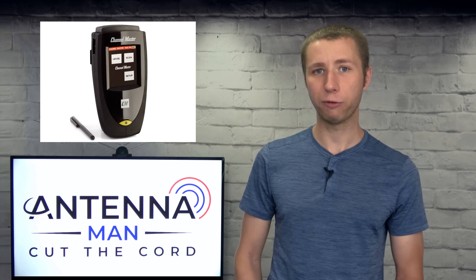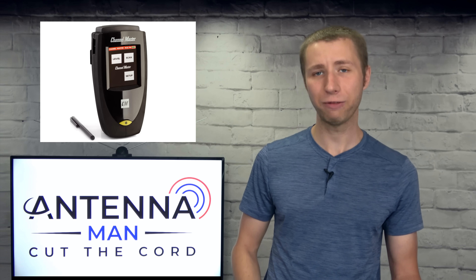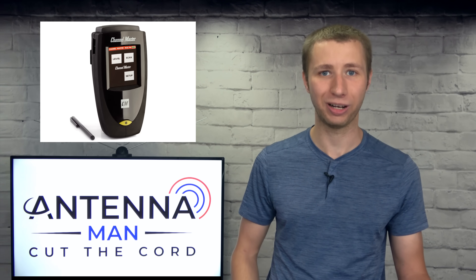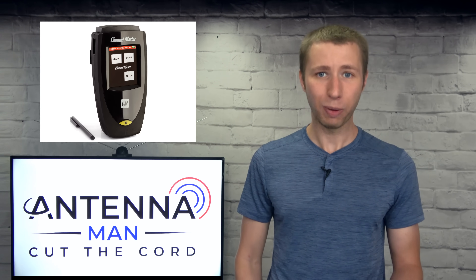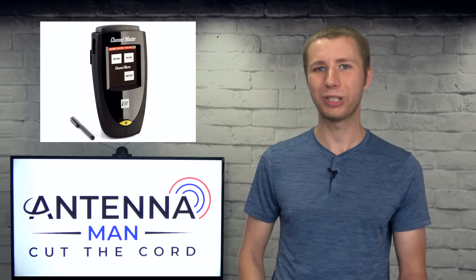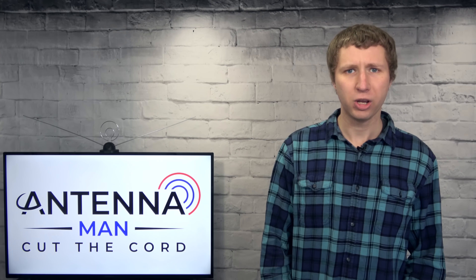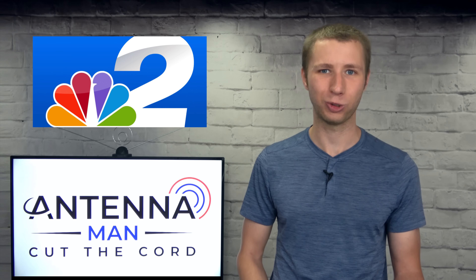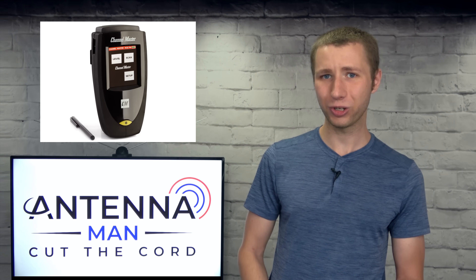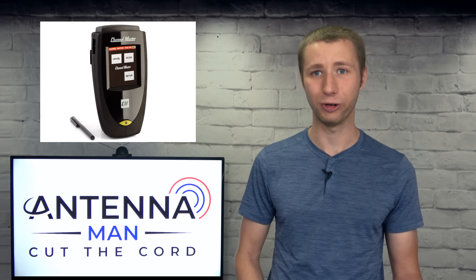While these signal meters are very handy for getting detailed numbers with an outdoor antenna, they might be tricky to understand for the average person. You have to type in the RF channel of TV stations in your market. For example, to tune to CBS3 out of Philadelphia, I'd go to channel 30, because that's the channel the station broadcasts on. Most TV stations don't necessarily broadcast on the channel number you may know them as. If you understand that your local channel 2 might be broadcasting on UHF channel 23, you have the knowledge to use these types of meters. If you don't understand virtual and RF channels, stick to one of the consumer-grade models.